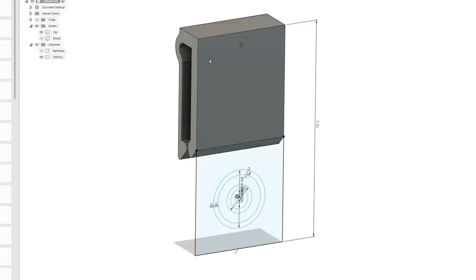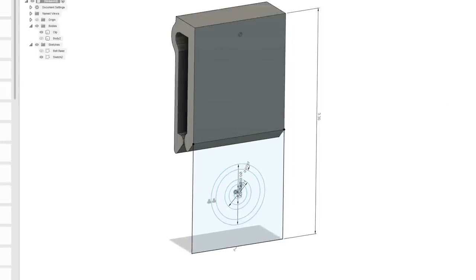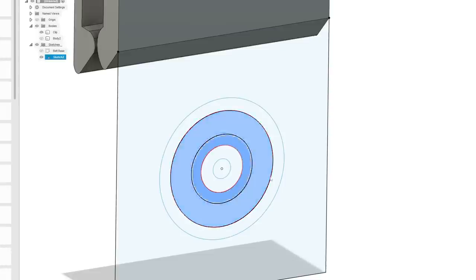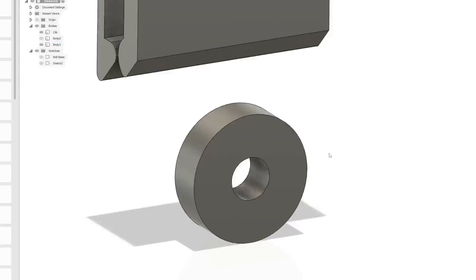Because originally I thought we could have some screws here, here, here, here. However, we probably will want some sort of cap to actually hold this in place. Well, let's do this. Let's finish the sketch. Let's grab the bearing like this. That would represent the bearing itself. And let's extrude it 7 millimeters. So that represents the bearing.